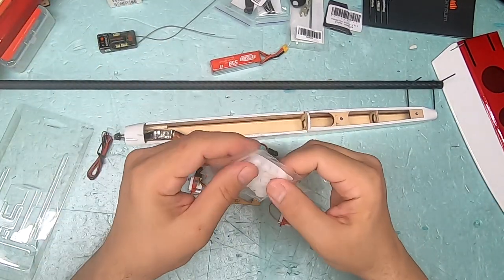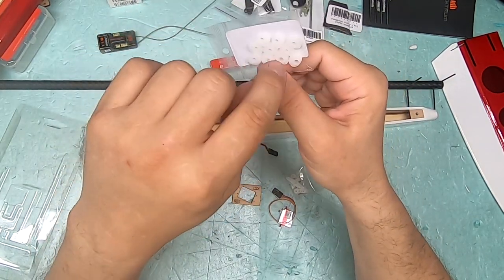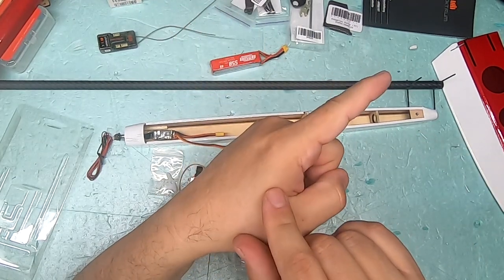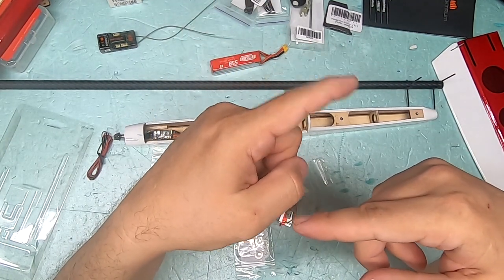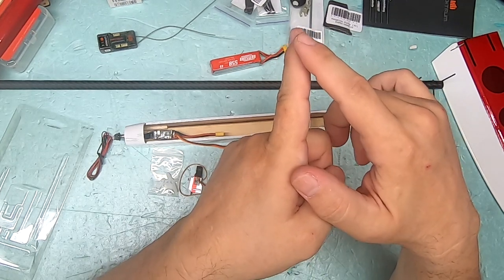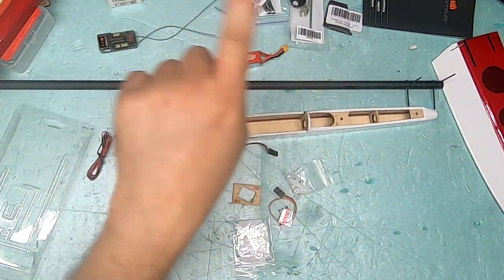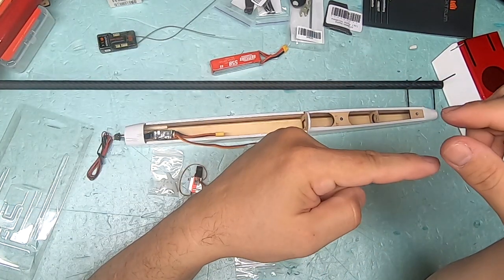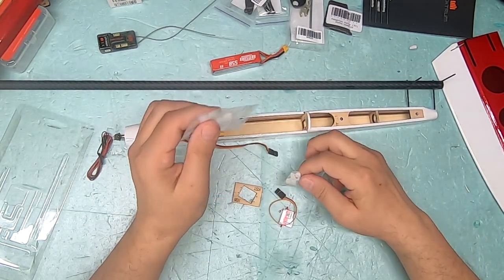And as I mentioned before, I had bought some of those wheels. Here they are. I intend to use these. Because it's a round pulley, it's a grooved pulley, as opposed to an arm, as the arm moves over, it also moves away in this direction. So you're kind of losing pull, whereas if you're using a wheel, like the apex of a turn, it's always there. As it rolls, you're always pulling at that same position, so you're going to get a much more linear reaction, whereas with an arm, the further it swings, the less it pulls in the direction that we need it to, and the more it starts tracking to the side. So I highly recommend getting these.